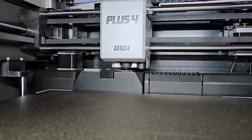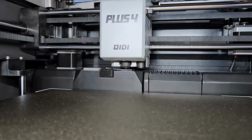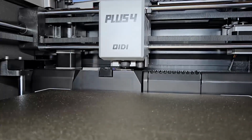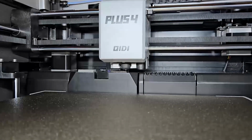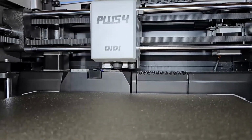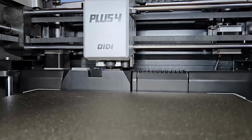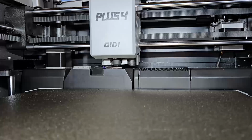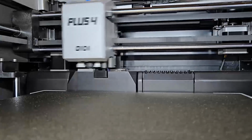Filament did stop extruding. It is cooling down to 140°C reasonably quickly, faster than the Robo 3D ever did, that's for sure. I had an E3D V6 hot end on that machine, stock fan and all that, and this is considerably quicker. You can tell it's pounding out a lot more airflow, plus it's got an integrated part cooler fan. 141, 2, 3, it's all over the place. It's holding temp, the numbers jump up and down, Jesus, that is fast.